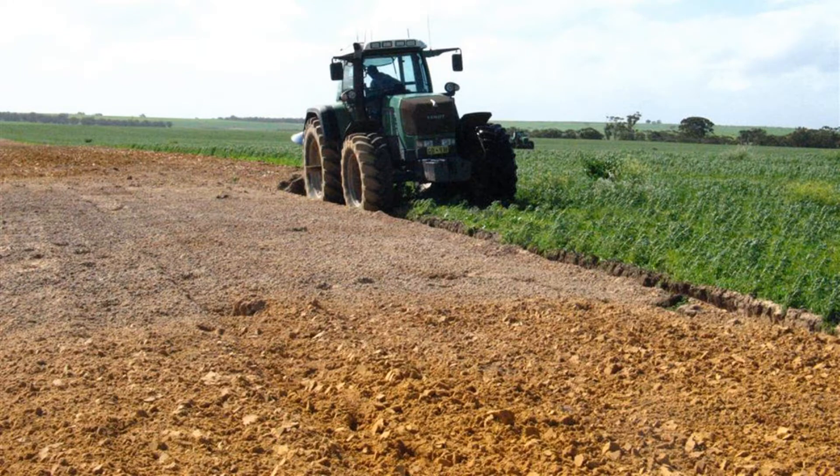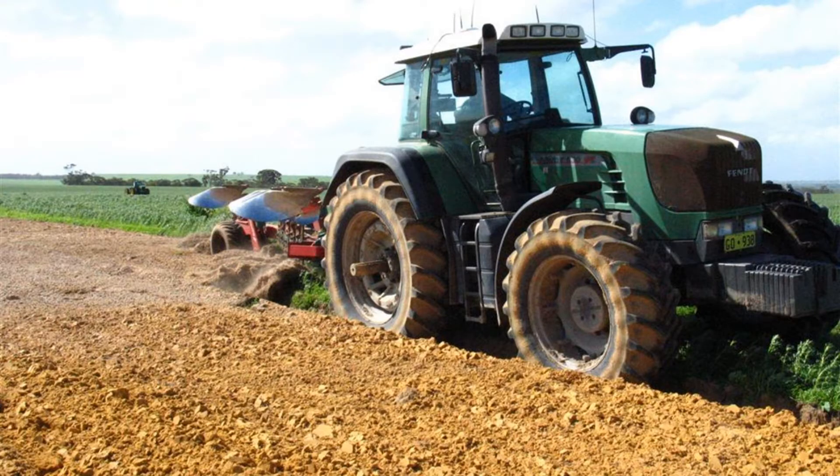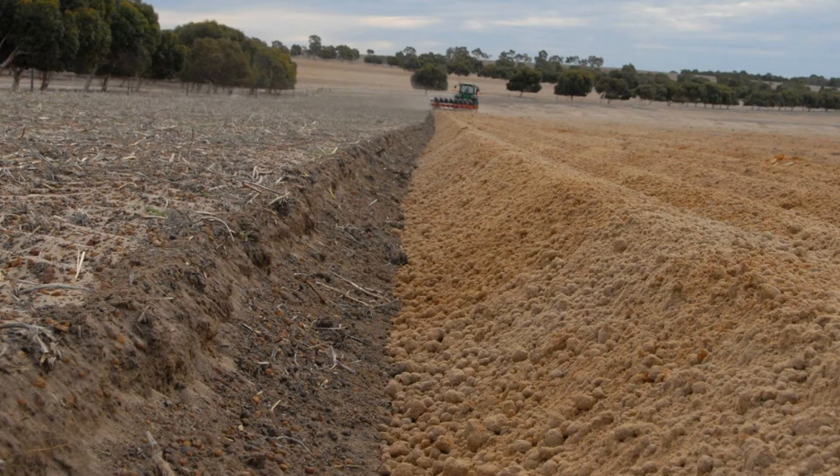However, sandy gravels that contain lots of cemented gravel within the working depth of the plough — that is within the top 40 centimetres — can result in poor quality ploughing, as the plough shares keep breaking out of the soil as they hit the cemented gravel. Generally speaking, in my experience I've seen good results on sandy gravels in the Badgingarra, Bulgart, Gumelling, and Minganue areas, but know of growers who have had problems bringing up rocks in the Irwin Shire and other areas.